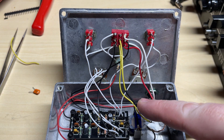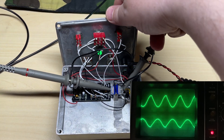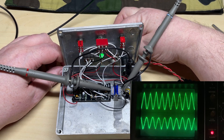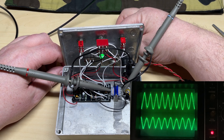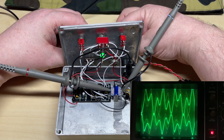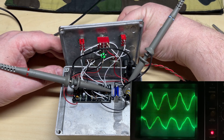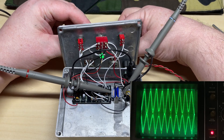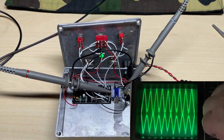On my first test I got a massive howl so I had to put the microphone through the switch. We powered it up — the top trace is the output and the bottom trace is the input to the transformer. The input level has been brought down because the output seems to be a lot lower, but that's good. As you can see the balance is mixing the signals nicely, and the level control turns the level up and down a lot better now it's got this audio transformer in.